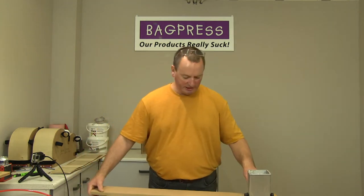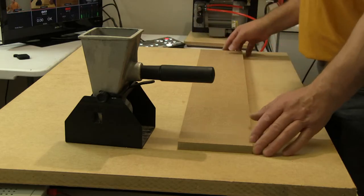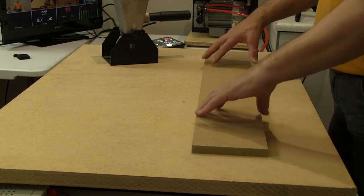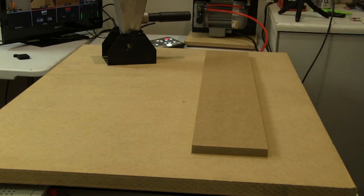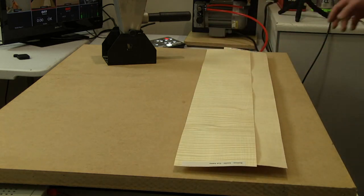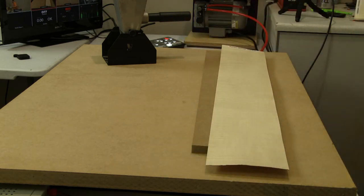Right, so what I'm going to do, I've got an extra piece of MDF here that I'm going to use when I'm gluing the veneer. It just raises it up off of the main bed, just makes it easier to hold it in place whilst I'm gluing the material up. Now, what I've already done is mark the side veneers